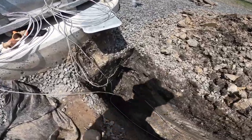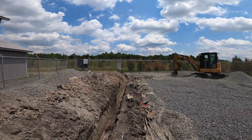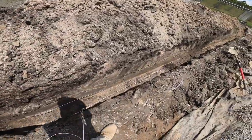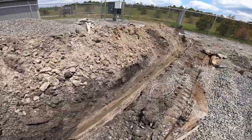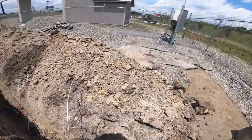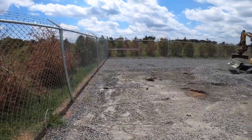We're all tied in to the tower ground ring. I tagged it in two different spots. They want the long trench — one continuous run with two long grounds in it, and that's the way we have it. We left two 16 to 20 foot whips going up, and all these other whips on the ground here are all going to be for ice bridge posts. That trench back there — we didn't find anything, but we didn't have to because we went right over the top of whatever was there. Got to look pretty good. Now we're going to do some layout on our pad over here. The area is cleared out. Let's see where this pad is going to sit exactly.